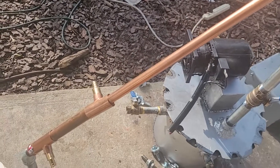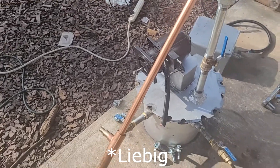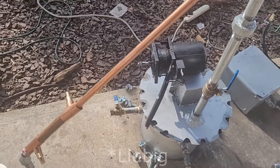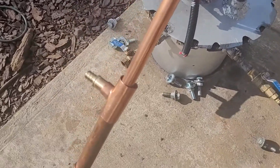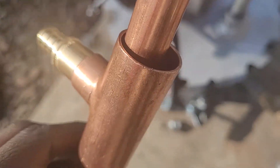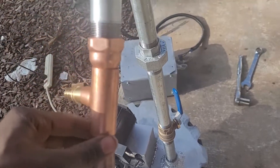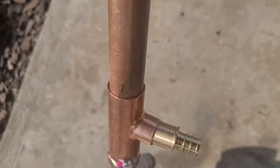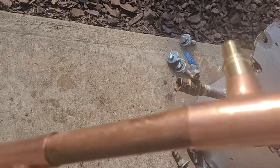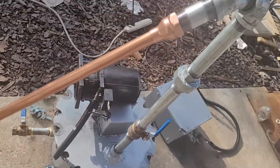Hopefully in theory those condense out before they get up here, because this copper pipe is thin — it's a half inch, not three-quarters. So we have pure, cleaner things coming through here into this copper condensing system. It's called a Liebig condenser. I kind of like to call it a Lagberg condenser because that sounds better. Anyway, this is roughly put together but I want to show you how it works: we have this inner pipe surrounded by this bigger outer pipe. Imagine this inner pipe extends through the whole length, and it'll all be soldered together so it'll be airtight and watertight.